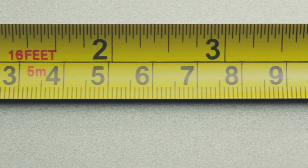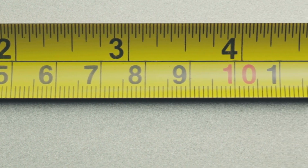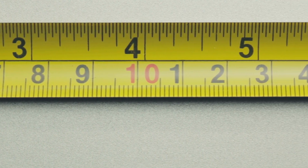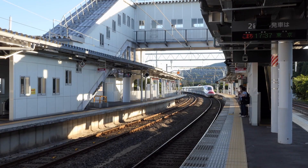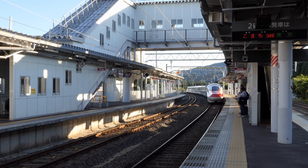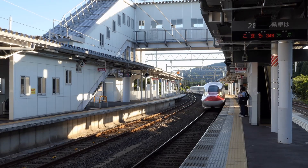What happens when a rail joint gap is off by just a few millimetres? Buckles, broken fish plates, even train derailments. This is a detail most passengers never see or are even aware of, but track engineers know it can make or break the track — literally.